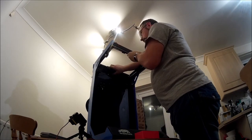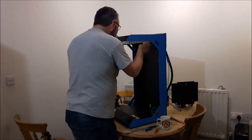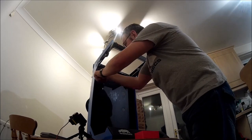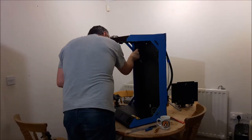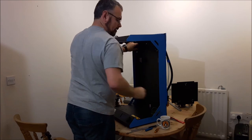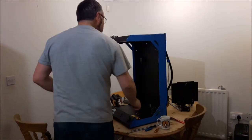The next piece is the belts. More importantly, the stepper motor on the right-hand side — you can't actually get in behind it to get the belt out. You can on the left-hand side stepper, but not the right. So you need to take that off; there are three nuts that hold a metal bracket that holds the stepper on there. With those nuts undone, the stepper assembly with the bracket just comes away.